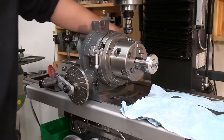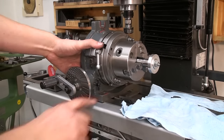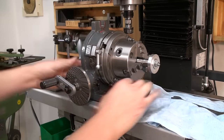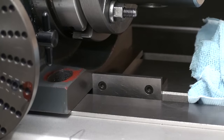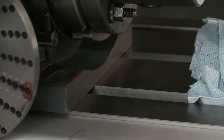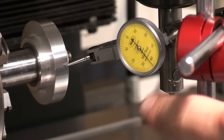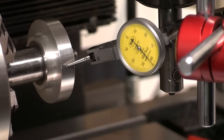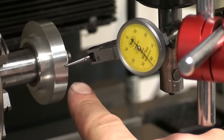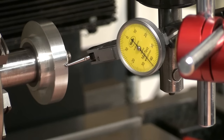Okay, I flipped the rotary table up and I already have one screw back here holding it to the table of the milling machine, so I can rotate it still around that bolt. Now I'm using a small square to give it a rough alignment. Okay. That should be not too bad. I tightened down the rear bolt. Now we can set up a second clamp here and check with the indicator if our setup is good. I set up a dial test indicator against the gear blank to check if it's in line with the axis. Just watch. Granted, we have a very short line to measure, but that's well good enough. Just by aligning the rotary table with the square.